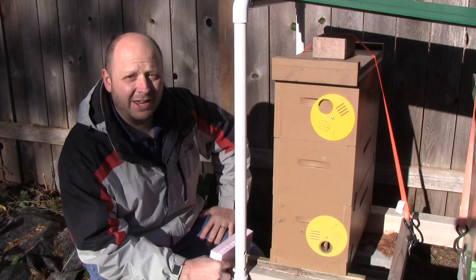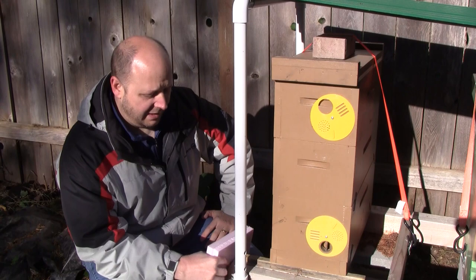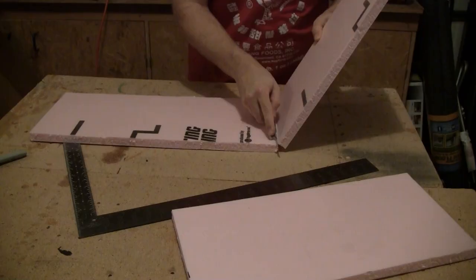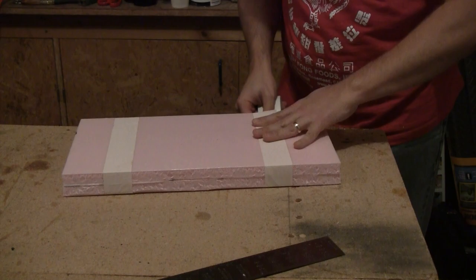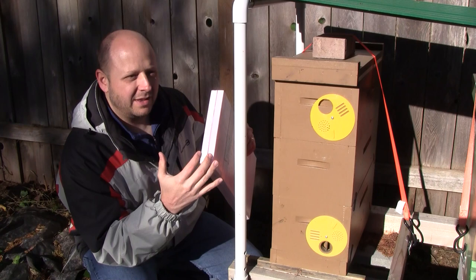So I'm going to be putting on about an inch and a half of styrofoam. I made these boards from scrap styrofoam that's been sitting in my garage for a few years — you've probably seen it in the background of some of my videos. I cut it to size, stacked two pieces together, and taped them so they stay together. I'll just be stacking it on top of the lid. The idea is that it will keep the inner surface of the lid a little warmer to prevent water from condensing — instead the moisture should just vent out through the upper vent.